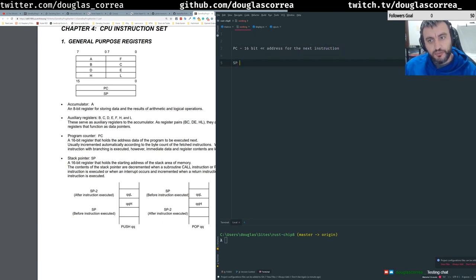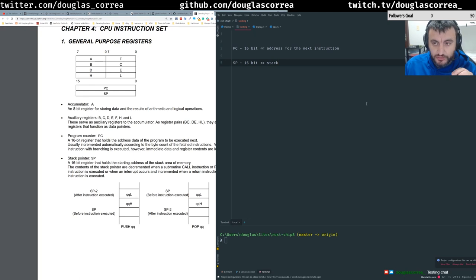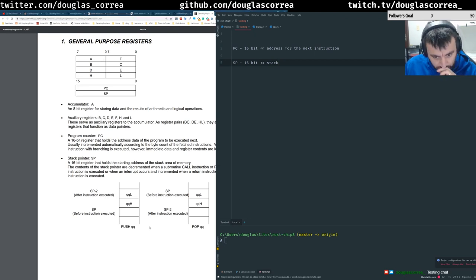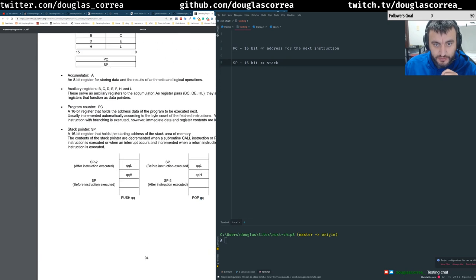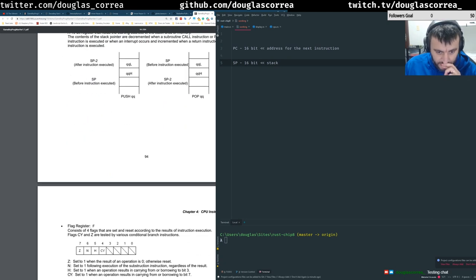And also we have the SP, which is also 16 bits, but this is the stack. It's used for branching the code, going to one function and getting back to where you were. So you build a stack for this. And also this F register is a special one because it holds the flags